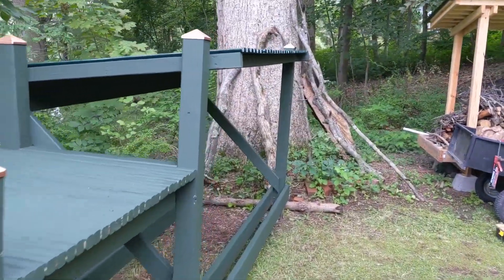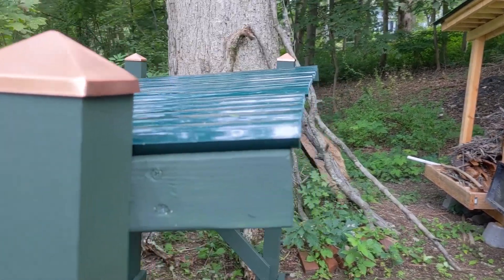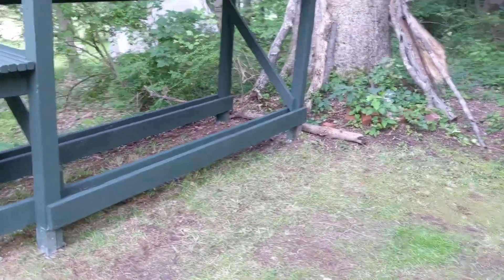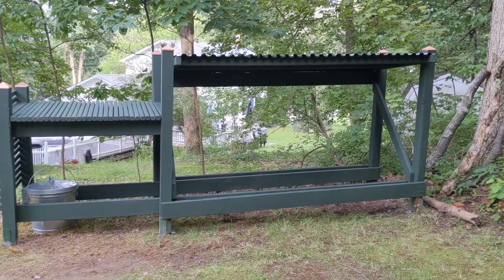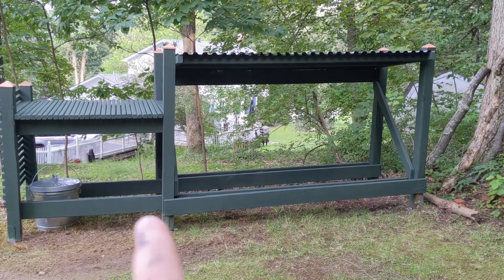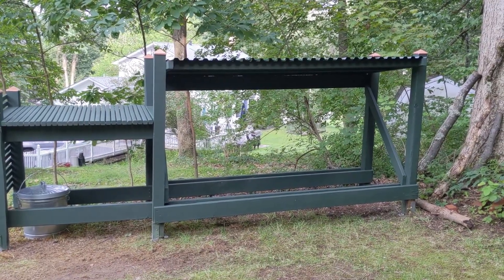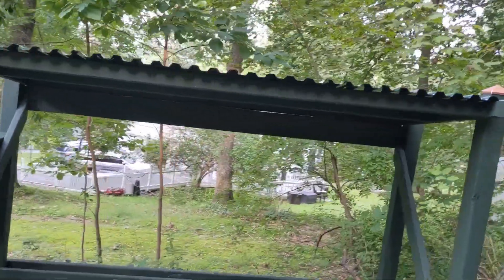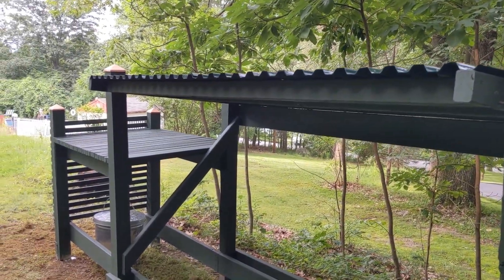You can actually see how poorly I did with the roof — if you kind of critique it, it's because this is all not a perfect square. I measured the diagonals and everything, but just through the natural process of building it and not really caring, it's not really squared up. If I was to do it over, I think I'd make this a little bit smaller — instead of eight foot I'd do six foot. I think the proportions would be a little bit nicer, more of a two-to-three ratio. I'd also paint everything before putting it in, because if you saw me painting it was kind of a little bit of a nightmare.